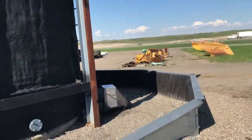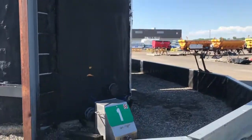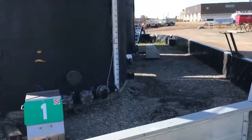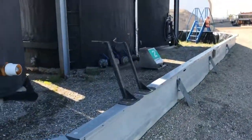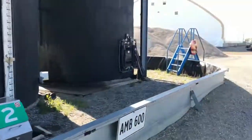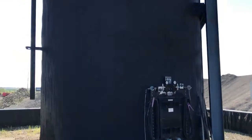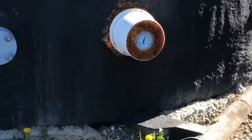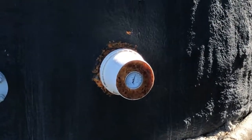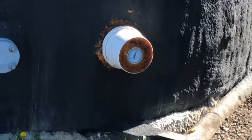We're able to get these tanks up to 70 degrees Celsius, and these are 400-barrel tanks, insulated and equipped with the truck-out boxes. You can see here tank number one, tank number two, and tank number three. Tank number three is off today — no fluid inside of it. And you can also see that we're pretty well at 70 degrees Celsius inside of this tank with 40,000 BTUs.